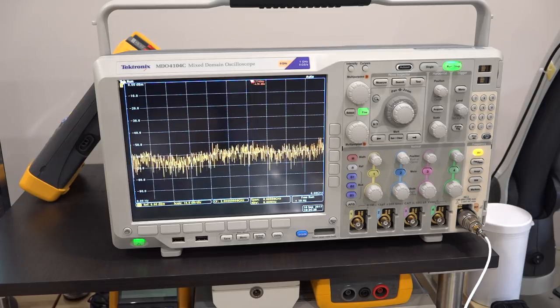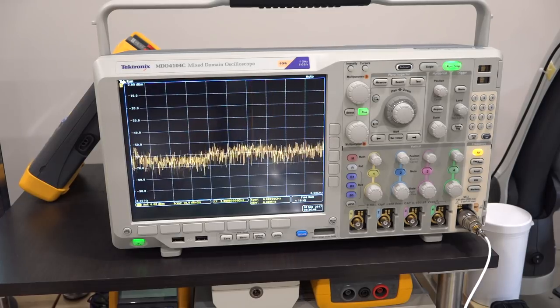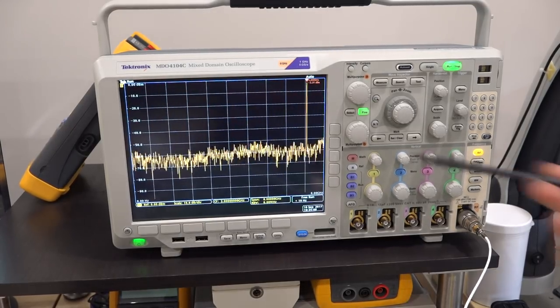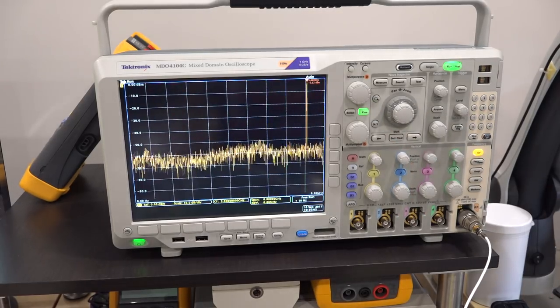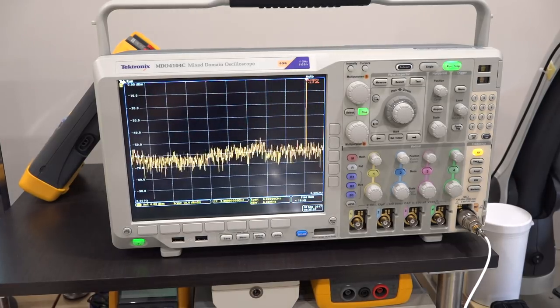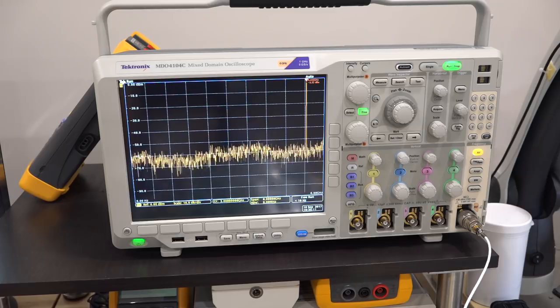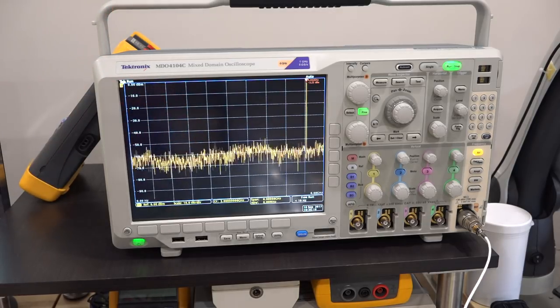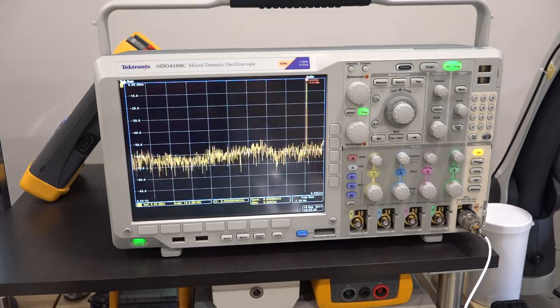I'm going to go to frequency, set a center frequency of 1 gigahertz, and put it into zero span. There we go — as you can see, it doesn't move around anymore. That's a good sign. The signal coming out is 5.448 gigahertz, pretty stable, not moving. Now we can try moving the center frequency and see if it tracks. Even if the PLL is unlocked, it should move because the main coil will bring the YIG close to where it should be. The fact that it was moving around already means that section is okay.